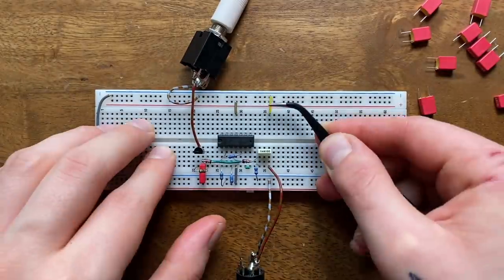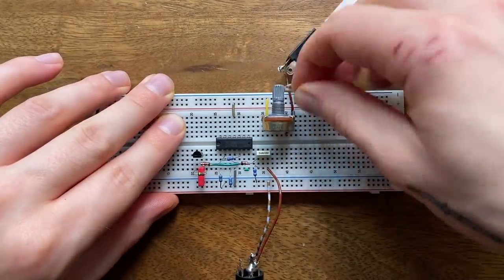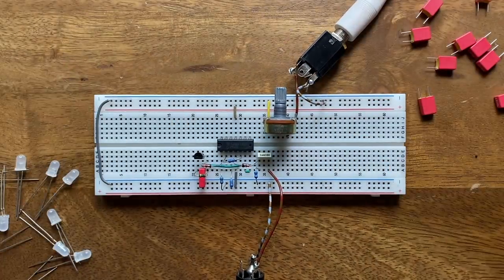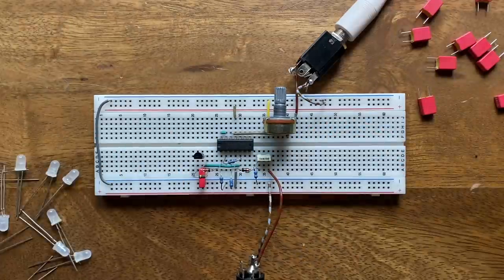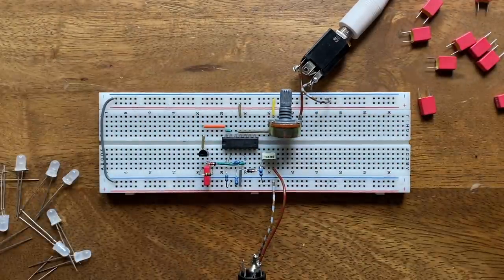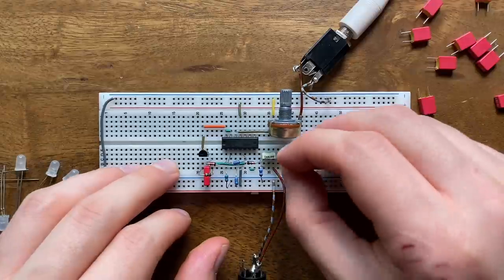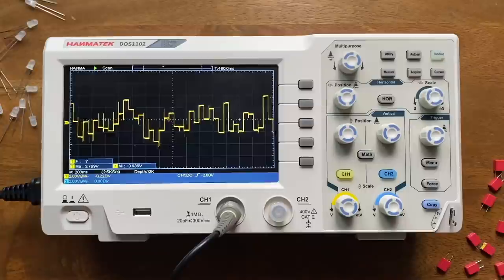So I'll set up a 100k potentiometer over here. Connect it to the signal input and to ground. Hook the middle connector up to another op amp, which I'll again configure as a buffer. Send that buffer's output into our JFET, put a 1K resistor between output buffer and output socket, and we're ready to give this a final spin.